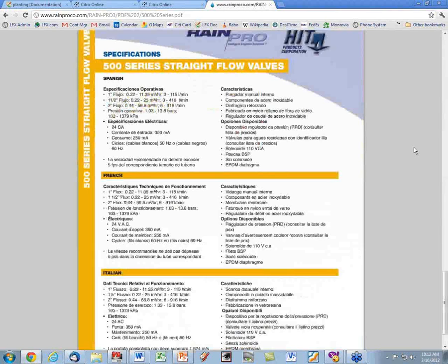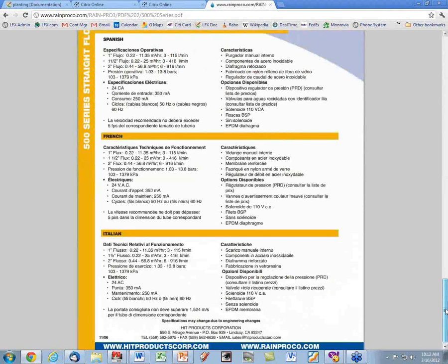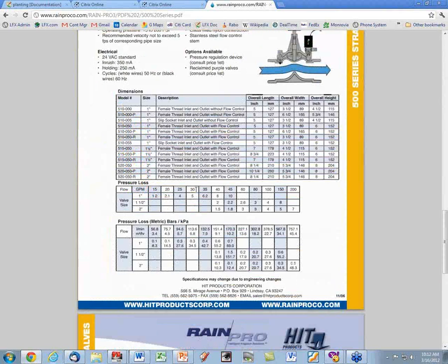What I tend to do is go to different valves and see what they perform like loss-wise when you max them out, or see what sort of gallonage you can get at around 5 psi loss. So I'm looking at the 2-inch valve at a 5 psi loss. I'm getting 150 GPM. Just comparing one valve to another, because if you can gain 2 or 3 psi by using a different valve, it may make a big deal in your design, because often pressure is critical in most situations, and every little extra psi you can get is great.